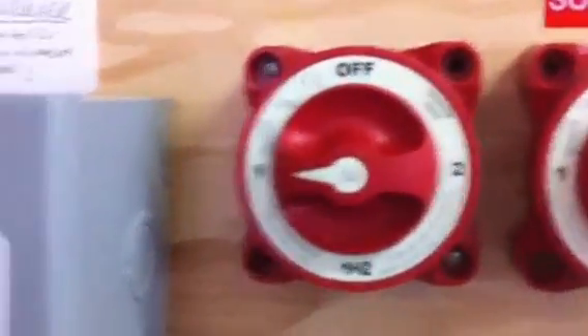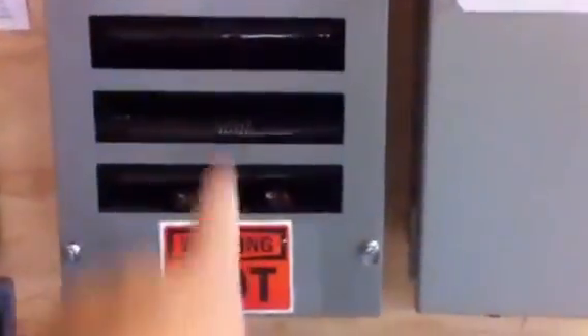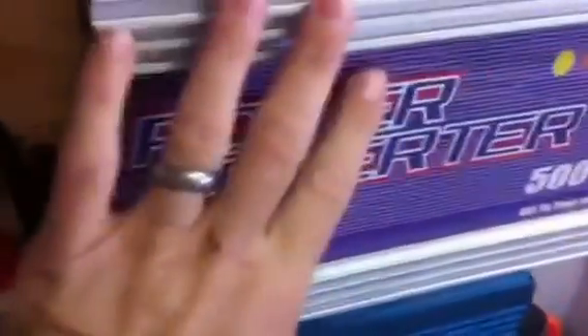While I'm waiting, I think I explained in another video: once the batteries are fully charged, it'll divert to here, feed the grid tie inverter, put the watts right into my house and roll back my meter. And if this were to fail, this dummy load goes from here to this bank of resistors to burn it off as heat. But it should never really go there — the only way it would happen is if this relay failed, and then this died, maybe the grid went down because they're island protected and it wouldn't work, or this malfunctioned.